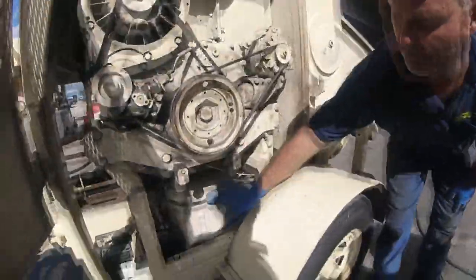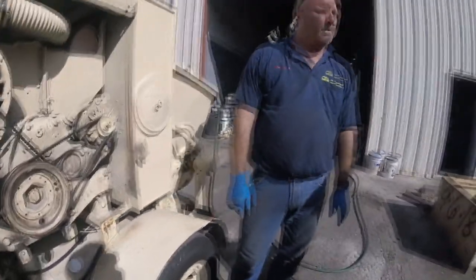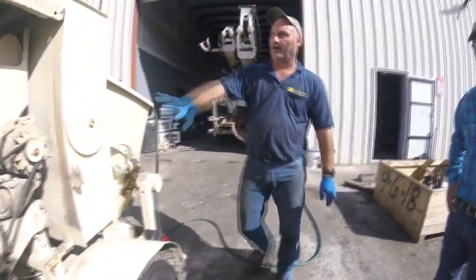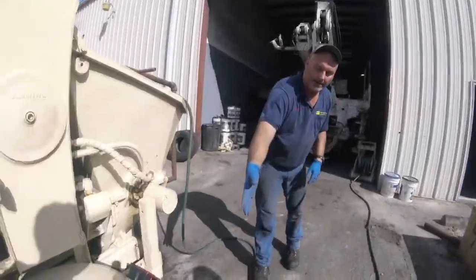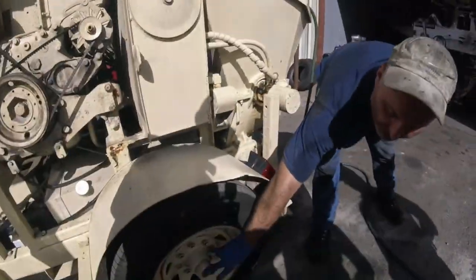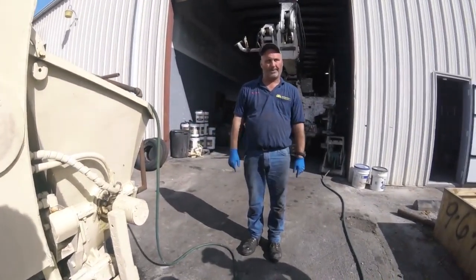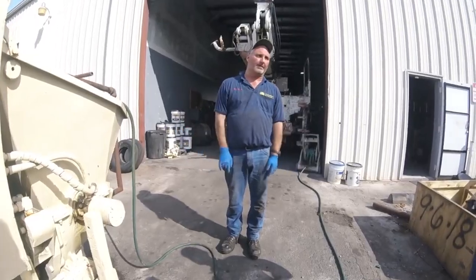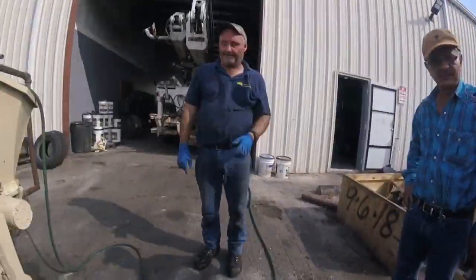Fuel tank, battery, 15 gallons and 31C. Screw top, battery. Right, so you got hydraulic tank. Working to the back end, Will, you got your trailer bearings here for your bearing buddies. Just grease them once a month. It goes on mileage, you know, you get 1,000 miles, I grease them. If you don't, then do it once a month. So when you guys get back home, you should grease it, because you're going to be driving 1,000 miles.